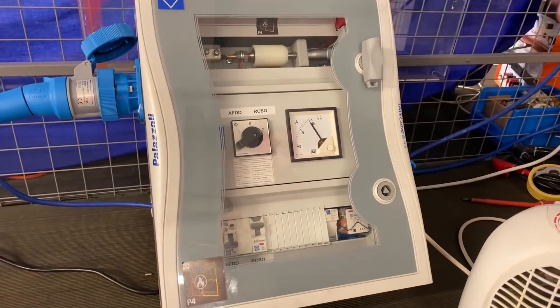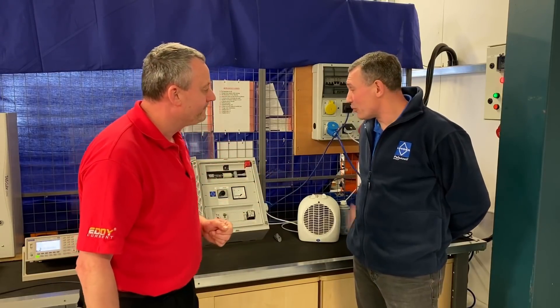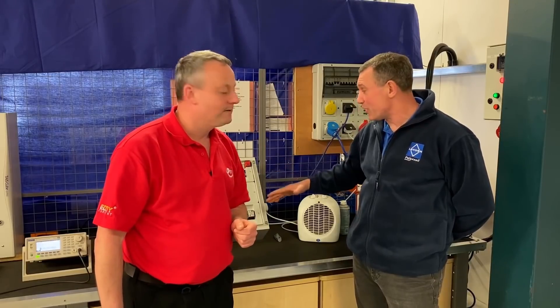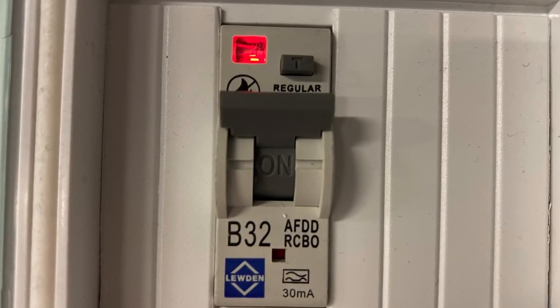That's happening in circuit and nothing's happening to the RCBO — so that's a real risk of fire. We measured this with a thermal imager and we're generating around 200 degrees, but these types of faults can reach up to 6,000 degrees. The RCBO protecting that socket outlet circuit up to 32 amps did absolutely nothing. With a series arc fault you're not going to generate an increase in load current, so the device won't trip on overload, and it certainly wasn't an earth leakage fault — so the RCBO simply can't respond.